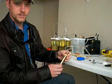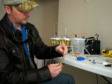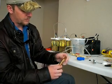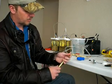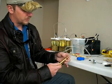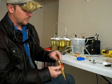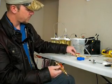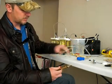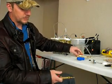Whenever you turn on your electrolyzer, you're going to want to put a little bit of water in here. Keep the top end a little loose so you can put some water down in this end, and once it starts to drip out of the other end, you know that's enough. You don't want to soak it, but you do want it damp for the flame arrester to work properly.